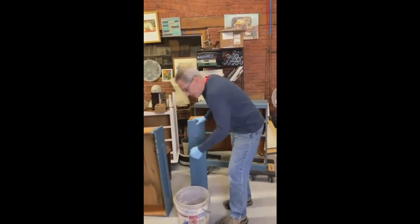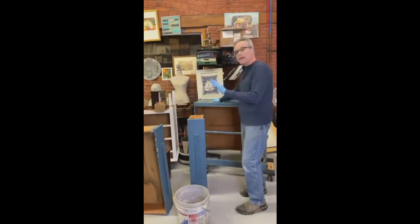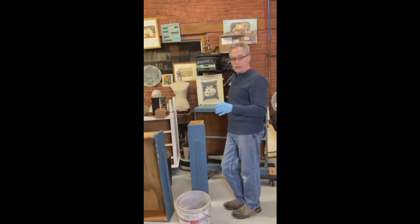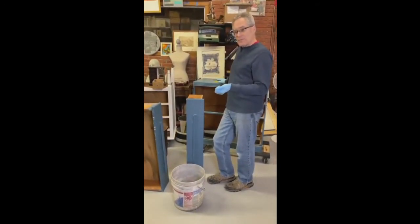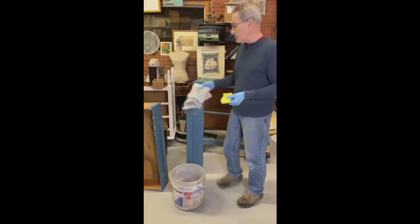The other way is washing like a kitchen table — you still mix TSP in the bucket, get your sponge, wring it out, and wipe it on, the way you'd wash your kitchen table after dinner. Because I'm inside today, I'll typically wash like a kitchen table. I've got painting canvases down on the nice enamel-painted concrete floor. TSP is a great surfactant — a very hard-working cleaner. When you're finished with your towels, throw them in the washing machine and anything in there will get cleaned too.